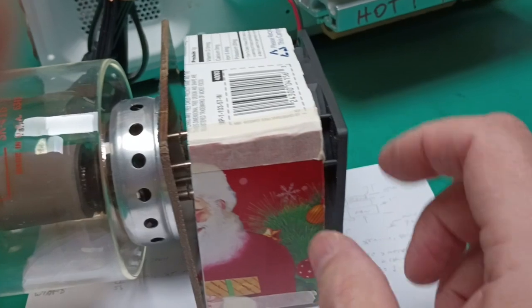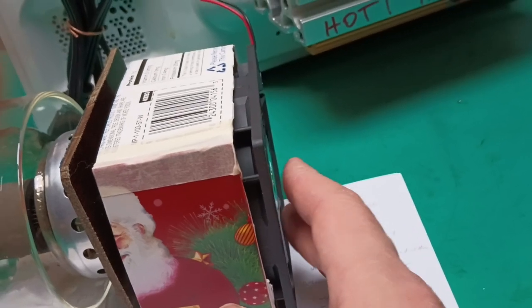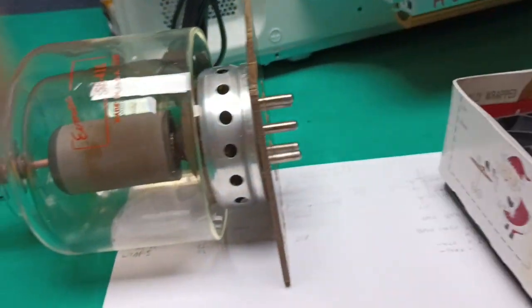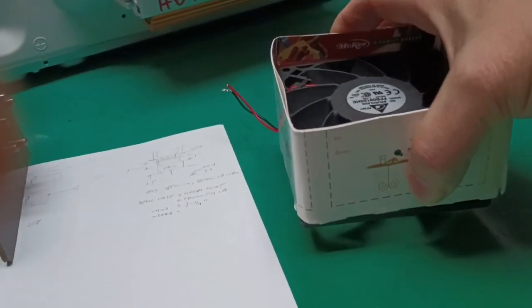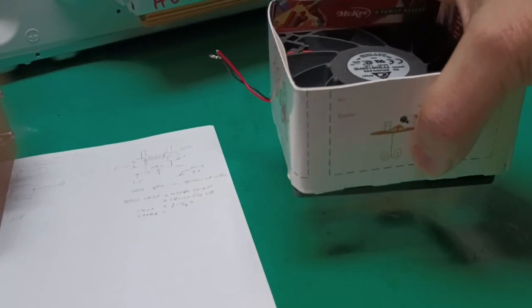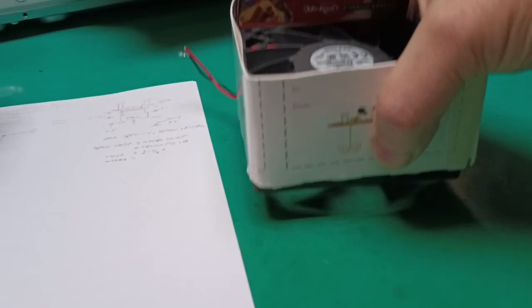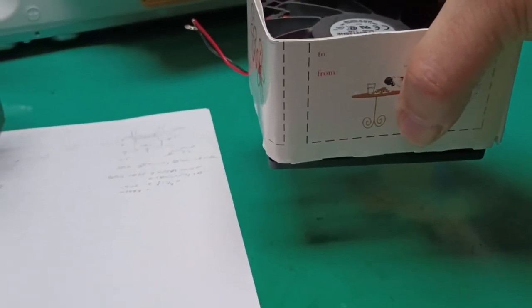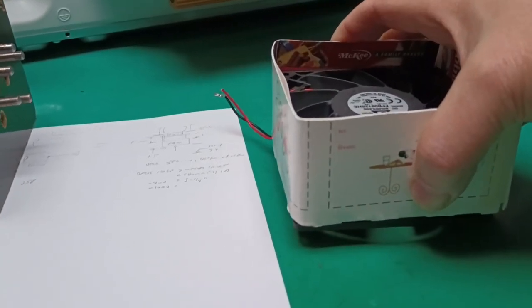What I was surprised to find is that if this is vertical, there needs to be a clearance under this fan, between the fan and the bottom of whatever enclosure is under it. I found that it needed about 3 inches spacing above, else the airflow started to drop off, and that was surprising. It can't be like this.